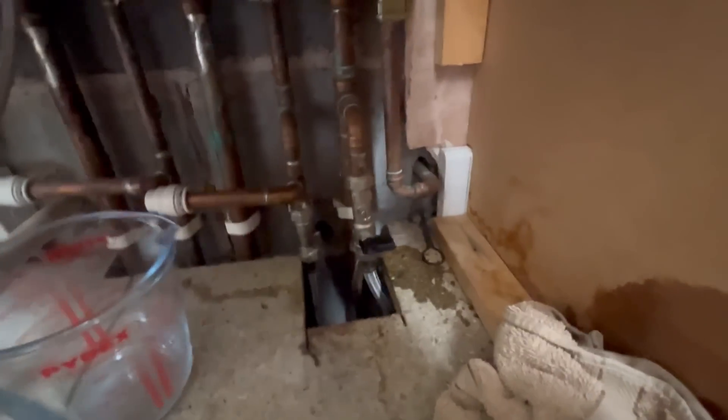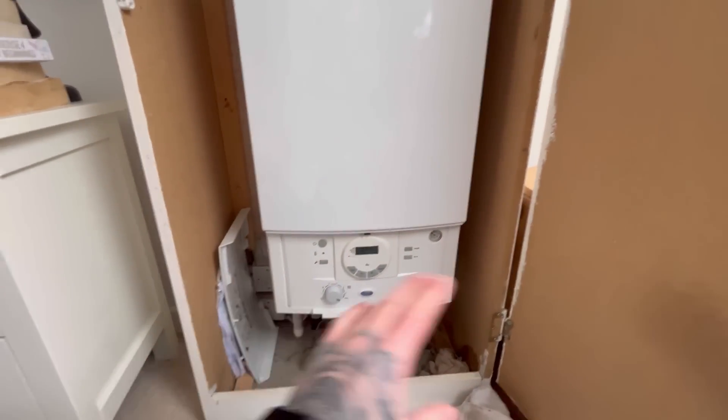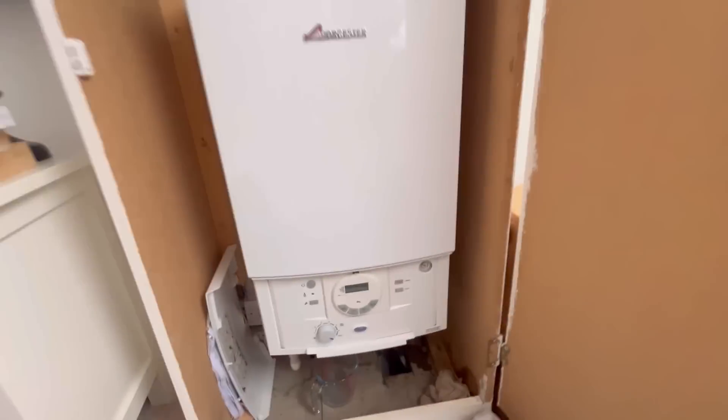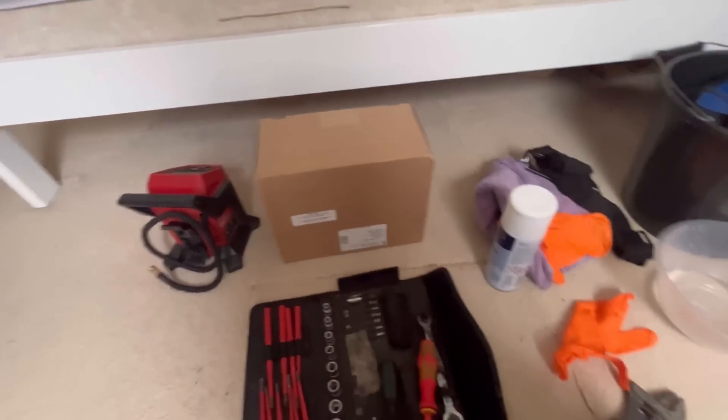This one we've been called out to is a leak on the boiler right hand side. Boilers normally leak from the right or left hand side, symbolizing one of the manifolds that's gone. But if it leaks from the front right hand side, roughly around here, then it's normally the flow adapter. However, this one's dripping on the PRV connection, as you can see. We'll get the cover off and see what it is - I already know what it is, I came out the other day to diagnose it. A lot of engineers find this job daunting but it really isn't.